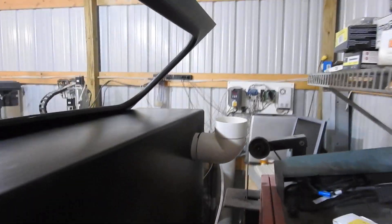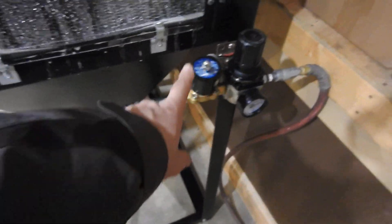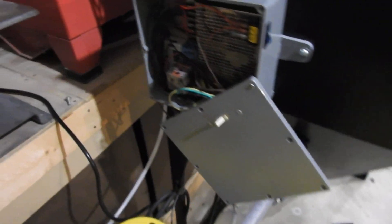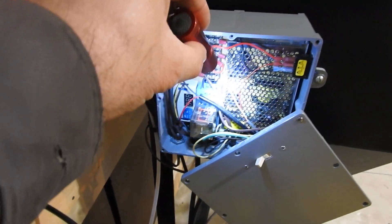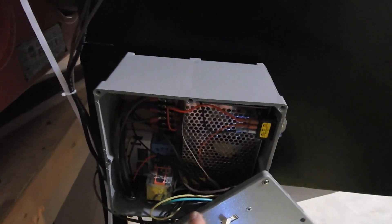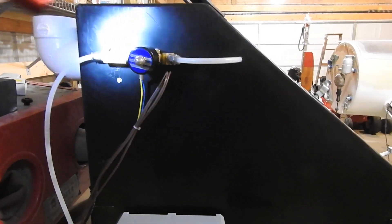The back of the cabinet has a big vent there to let the air out from the blasting. There's a solenoid valve that works off of 12 volts DC. The pedal is 12-volt DC also. Over here on the side of the box, that little white box is a timer. The blue thing is the relay to take this 12-volt DC power supply and supply low DC voltage to all the solenoids. There's a solenoid on here — the air solenoid.